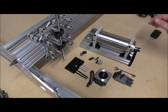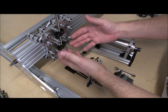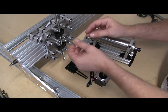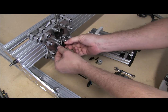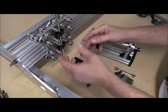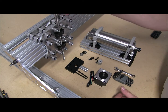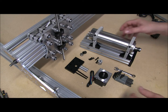These are Delrin plastic — you can literally melt these blocks running it up and down with a drill. I've seen it done a couple of times. So if the measurement's off, go ahead and take the whole thing back apart, run the screw through it, and tighten the bolts back up. Remember, these shouldn't be cranked in really hard into the plate. You want them just where they'll hold their position, and I've got zero play up and down. Once you get that installed, you're good to go.